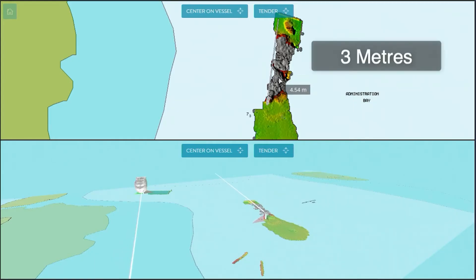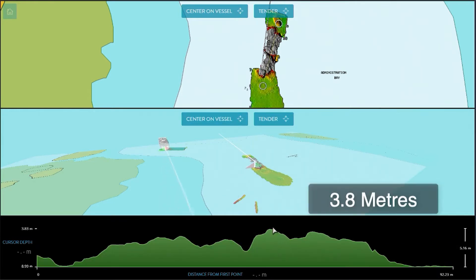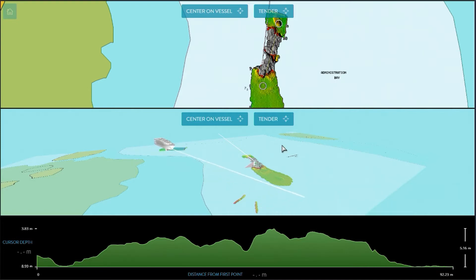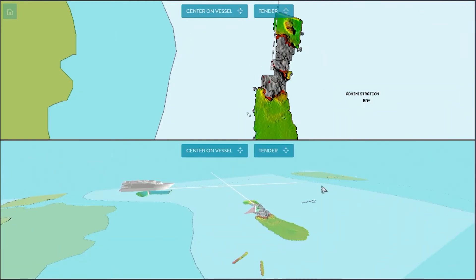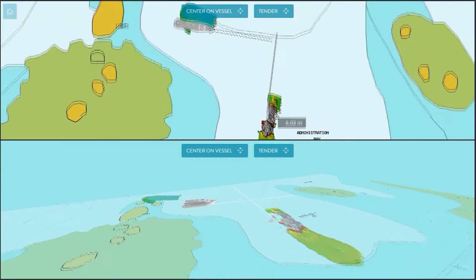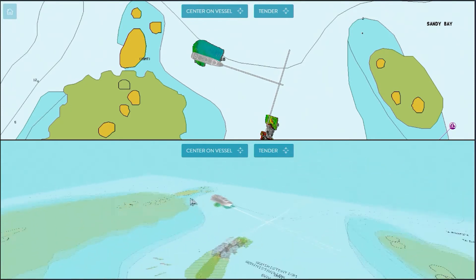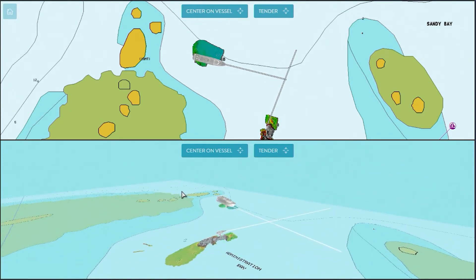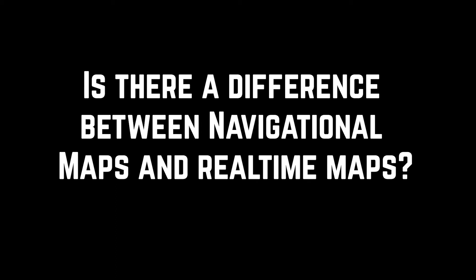Our superyacht draws three metres, and if we look at our depth cursor we can see we've found some areas that are less than three metres deep. Looking over here we can see it's shallowing out at 3.8 metres, with deeper spots around seven to nine metres, which is what the chart told us. So clearly there are some shallower spots we need to avoid. The good news is we're fed this information instantly and in real time from the tender to the superyacht's bridge, and we can see our map of the sea floor building up — giving us an accurate image of what the sea floor of the bay is really like.